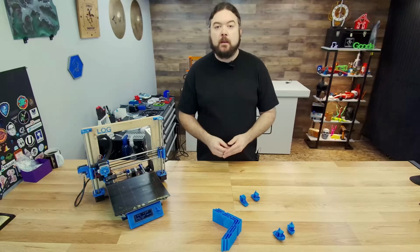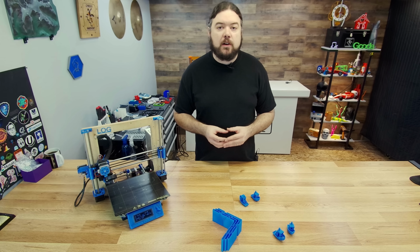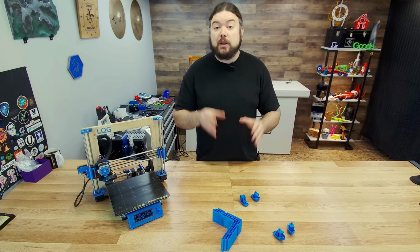Hello everyone, Chris here, and input shaping is no doubt an impressive feature that you probably want to try on your 3D printer. I know we've talked about it a bit in the past, but input shaping is basically resonance compensation. It's a way to solve a problem that every moving machine has inside the software. Your 3D printer is moving around quickly, stopping and starting, and when doing that, it's causing vibrations. Those vibrations can be seen on your 3D printed part. We like to call those artifacts ghosting or ringing, and Input Shaper does a really good job at mitigating those